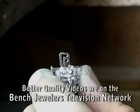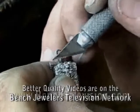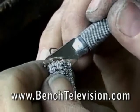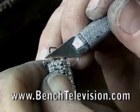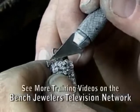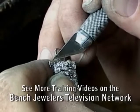But here's what the problem is. What has caused this clasp to get out of adjustment is this area right here. When this clasp was brand new, it was a very sharp crease. If you look at it now, this area is curved up and it no longer gets a good bite. So I'm going to go in with a saw blade and basically take off this metal to here and make this thing very square again.